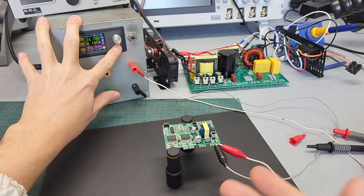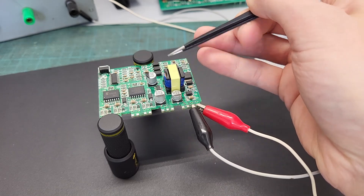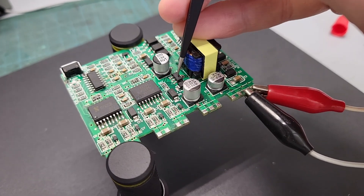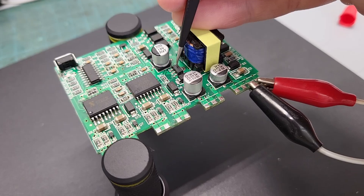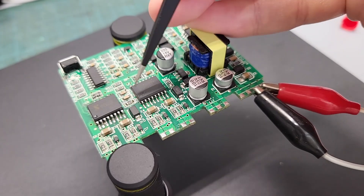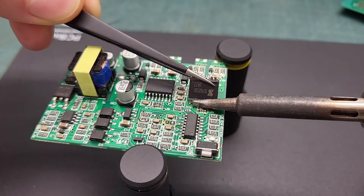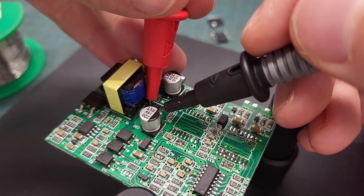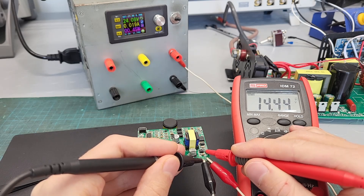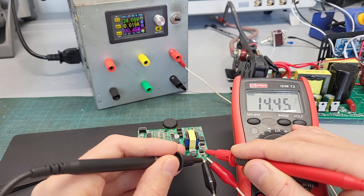After some reverse engineering of the gate driver board, I realized that half of the board is just for auxiliary power. I need to make sure that half still works while the other remains disconnected. With the thermal camera I quickly found the first chip that's overheating — a four-pin device that's just a 15 volt voltage regulator, a classic LM7815. It's overheating because downstream there are two gate drivers that are completely shorted, so the output is shorted. Once I remove the shorted gate drivers, the voltage regulator finally stops burning out and the auxiliary power is restored at around 14.5 volts.